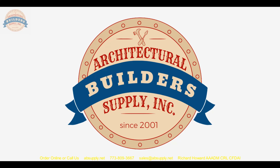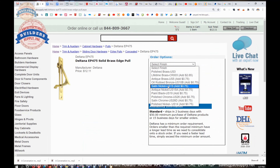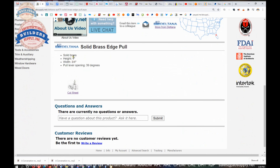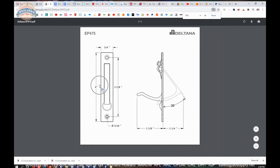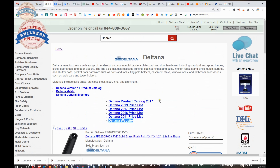Let's switch to the screen view and take a closer look at some supporting documentation. This is the item we are looking at, and it's available in different finishes: brass, bronze, chromes, nickel, satin, polished, and black. Specs show four-inch height, three-quarter inch width, pull lever opening 39 degrees. The cut sheet is a technical drawing of the item. If you're replacing one, you're really looking for three-quarter by four — it'd be nice to check the three and three-eighths dimension, and the rest should fall in line. There's a link below this video to the manufacturer's page with all Deltana products, as well as a link to the full product catalog.